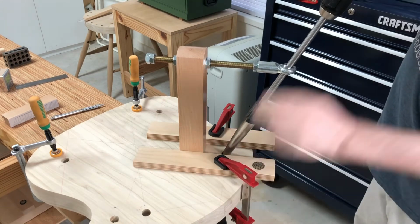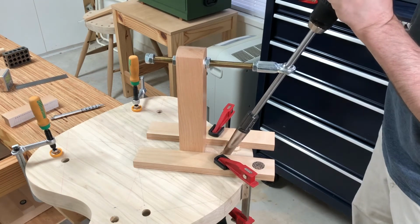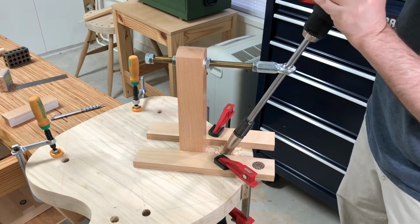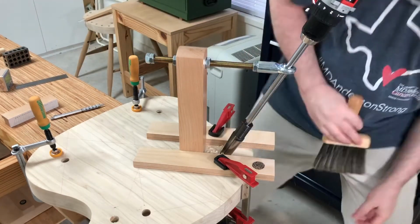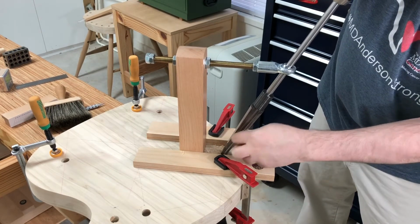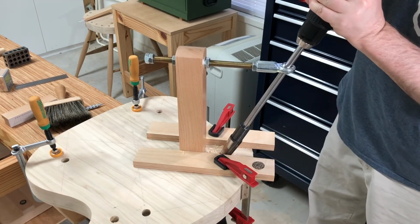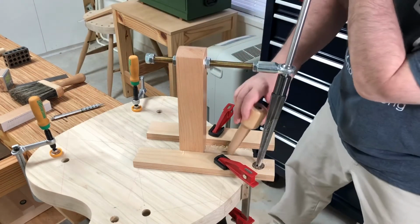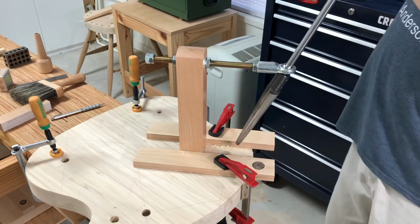Hello, voiceover Kyle again with you to narrate you through this. So we're reaming out these 24.5 degree leg holes on this poplar seat blank, and we're just going through this with the actual poplar I found, which is a little bit harder wood, just going a bit faster, still in #1 setting, and not wide open on the #1 setting, but just a bit faster than we do in softer woods like pine. So we want to take a look at that, and again use that small base with those markings to make sure that we're at the right depth, and there we are.